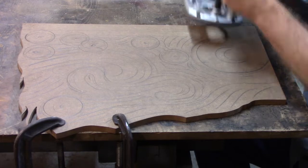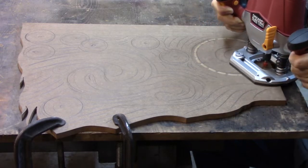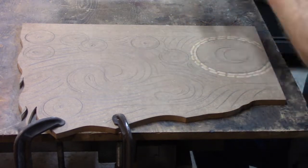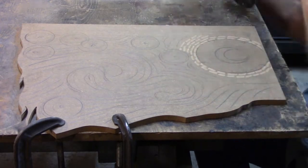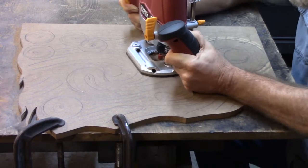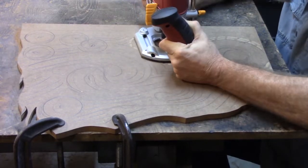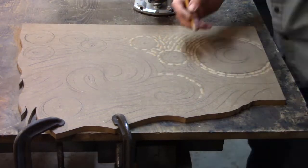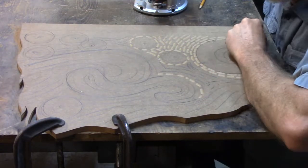Now for the carving of the sky. I have been looking forward to trying this, knowing it would be very difficult with my fixed-base router. I went ahead and bought a plunge router and modified the springs on it to make it even easier to pull down, and it worked really well. It took about an hour to do the whole sky and my arms were a little sore afterwards. I don't know yet what it's going to look like when I start to paint it, but for now I'm pretty happy with it.